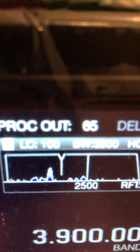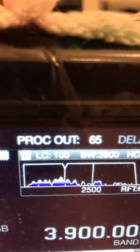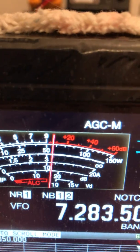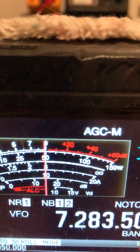You see that? It's right there. It's pretty narrow. It comes and goes in amplitude, but in frequency it stays the same place, right there. I'm going to just blank that sucker out right there, and look what it does to the signal. Look at that — I'm moving the knob. Now you hear it. Now you don't.